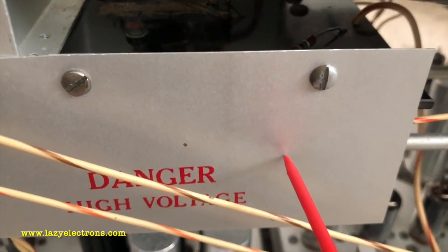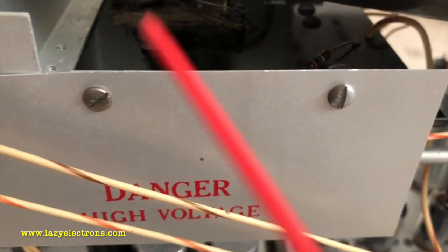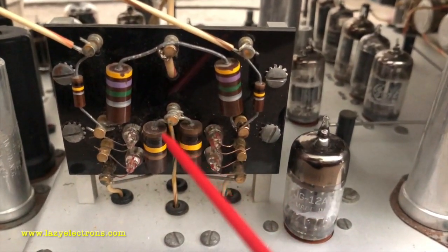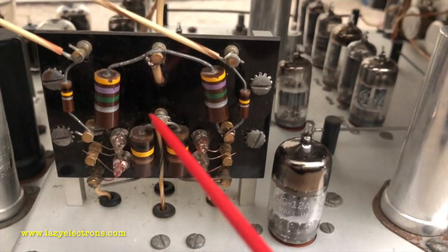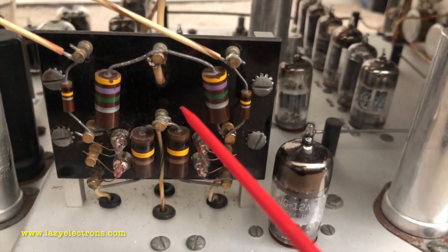This is where the blanking signal comes in, gets demodulated and mixed and gets applied to the CRT. That's the reason the focus and intensity controls are sitting here as well. This is the DC dropper board. This is used to lower the DC level of the horizontal deflection signal to closely match it to that of the final anode in the CRT. That's used for getting better focus.